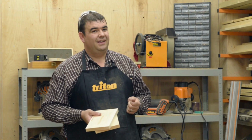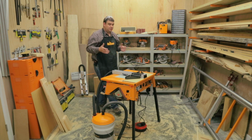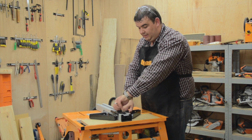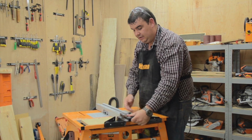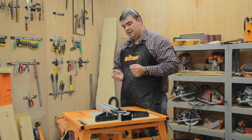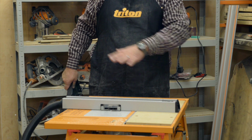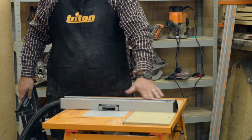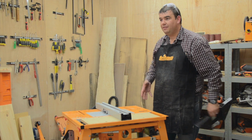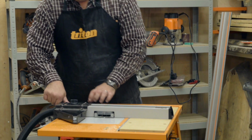And that's the biscuit joiner. It's such a simple, easy product to be able to use. It'll allow you to make very, very strong and quick laminates. Okay, you can also use the angled sides of the fence to do very strong and neat 45 degree miters. And being a biscuit joiner, it allows you to work very, very quickly using the scales provided. A handheld biscuit joiner just does not have the speed of use that this system has. Okay, great. So let's carry on.